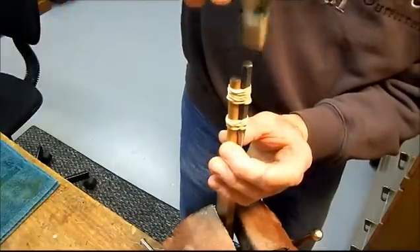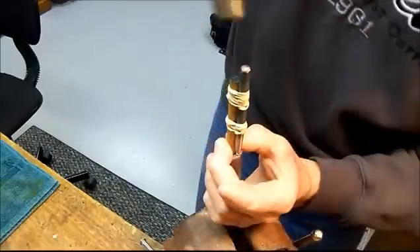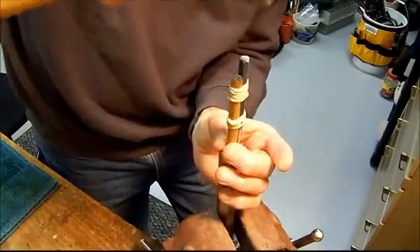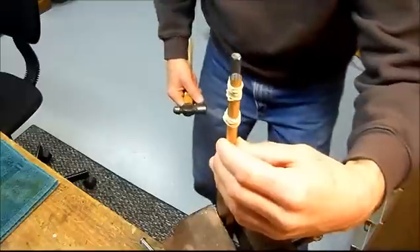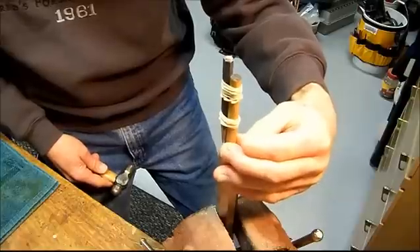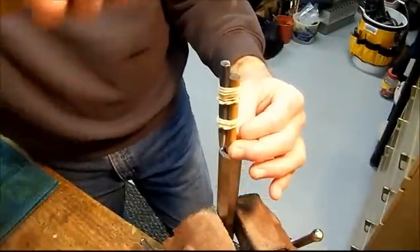I'm going to give it a very, very light tap — just so I can see that indent. The reason for that is if there is a mistake made, I can go back with just sandpaper and take off ten thousandths of the barrel, which is very very minute. If I was to give it the final tap right now and try to do the finish in the first tap and something was wrong, you would end up taking a file and shortening your barrel by quite a bit. It's a whole lot nicer to do it right the first time.